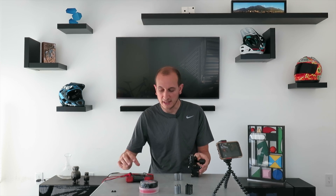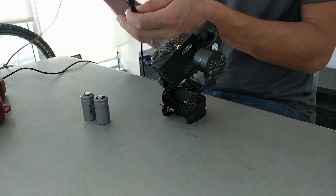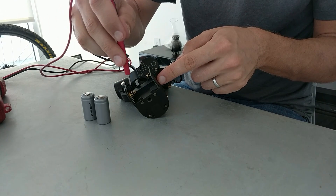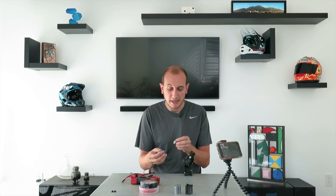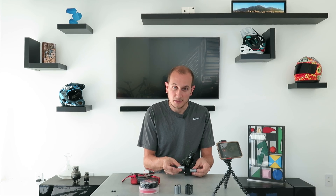To figure that out, I've removed the batteries and I set my multimeter into continuity mode — when these two probes touch, it beeps. We need to know if any two sides of the battery terminals are bridged or if they both go directly into the circuitry. When we test on one side absolutely nothing, but when we test on the other side they beep. That means this side is a bridge, so the batteries are placed in series — one after the other — which means we're getting the sum of the voltages: 3.7 plus 3.7 is 7.4 volts. So we need to get 7.4 volts in here.